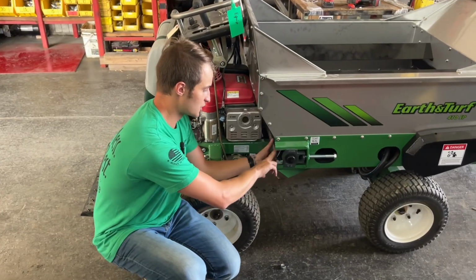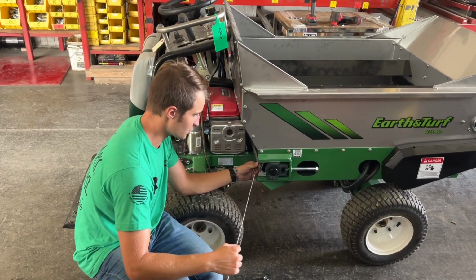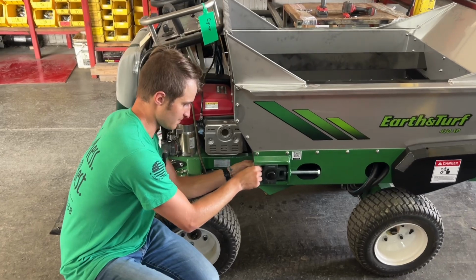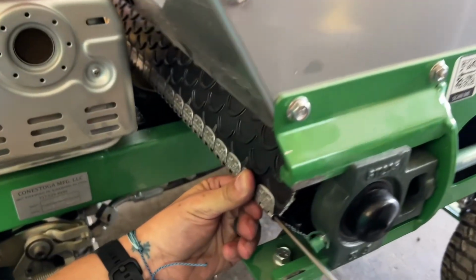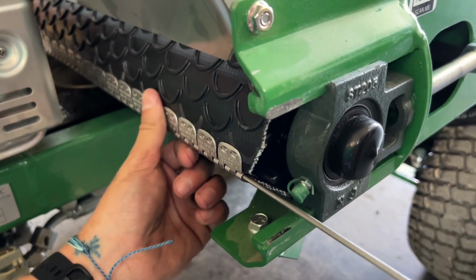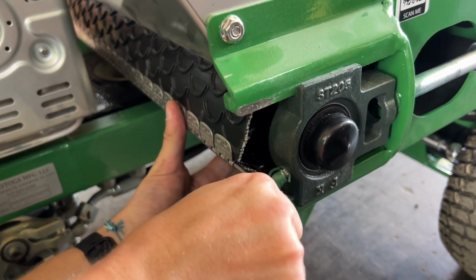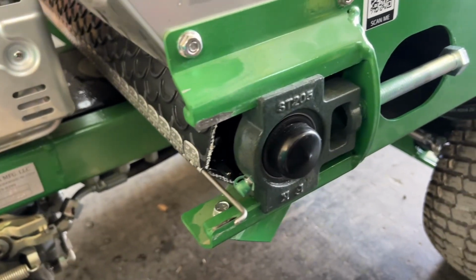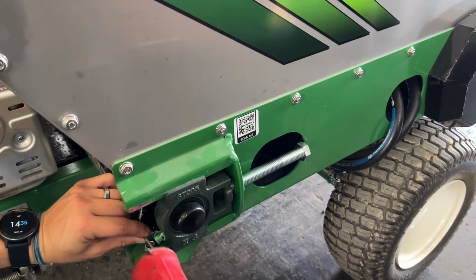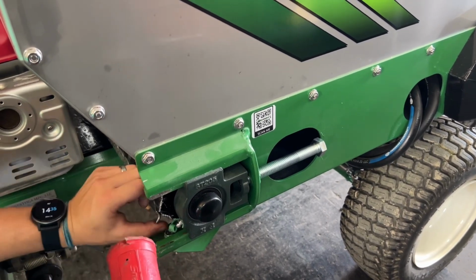Once you've got your jaws lined up, you can take the rod that we had earlier, your new rod, not the old one, and run it through. You just want to line these jaws up and go through one at a time. Should feed relatively easy once you get going. If you can't make that last little bit, a light mallet may tap it into position.